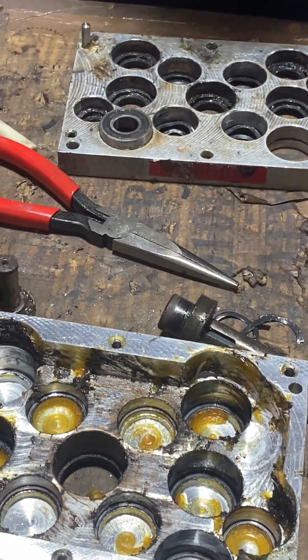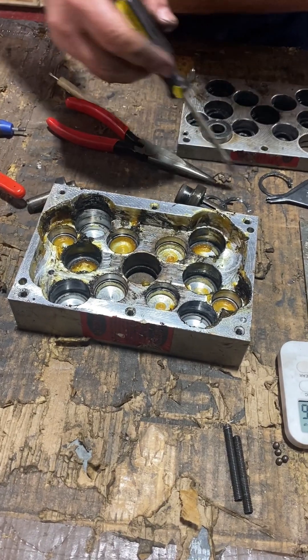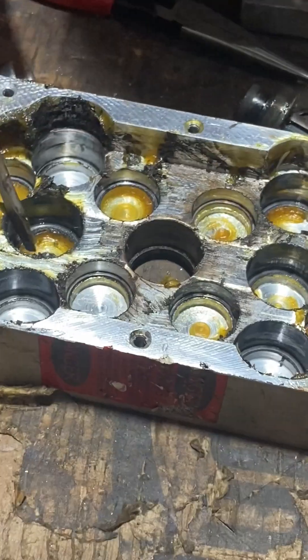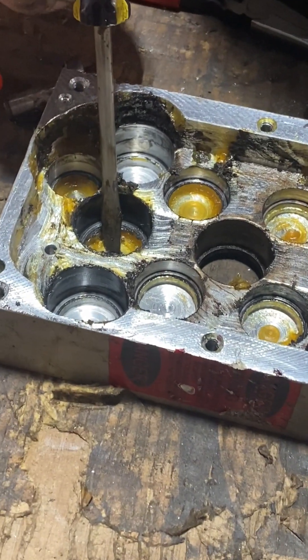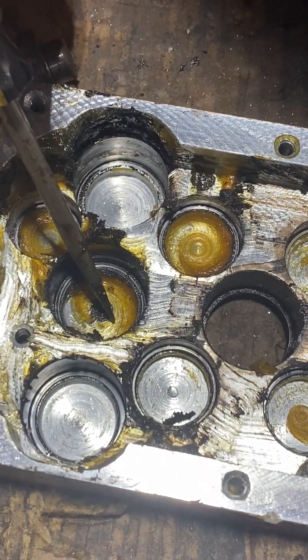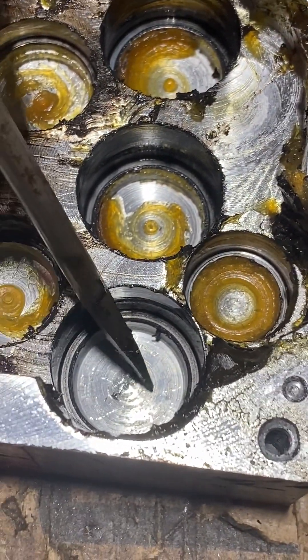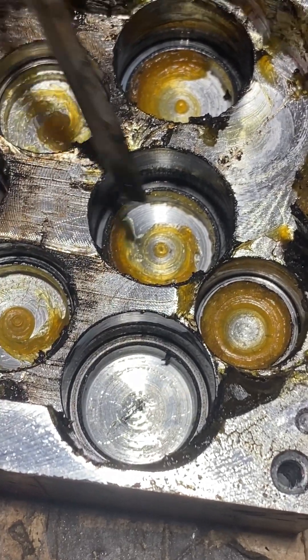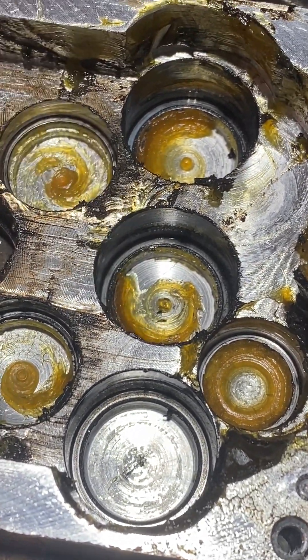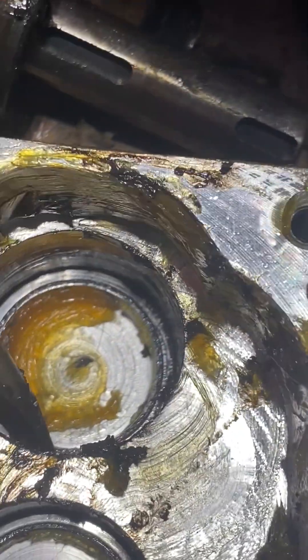There's another reason this head is going to fail as well. If we come over to the rear housing, you remember that all of these wave washers were broken. On the rear housing, if you look down in here, there's a quick telltale indicator — we've got this circular wear mark in the top of the spindle spot. And if you look here without the grease, I've got a similar wear mark there, and you can see the wear mark in the grease here and here.